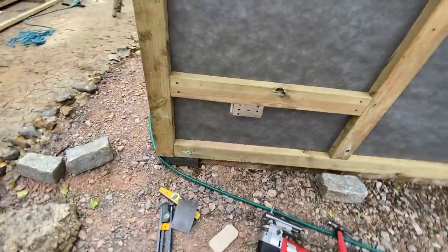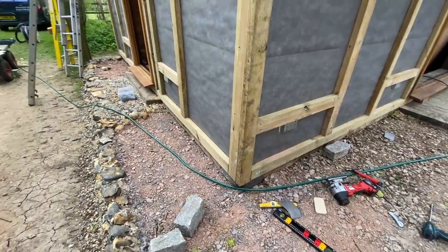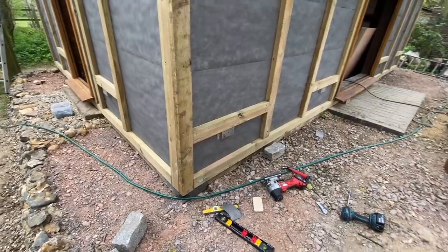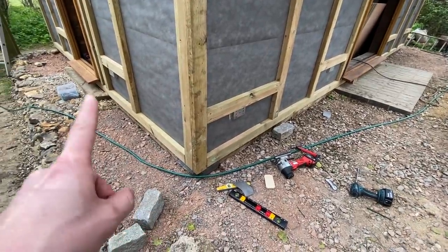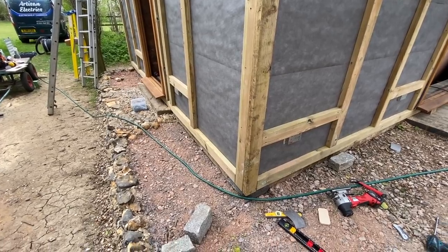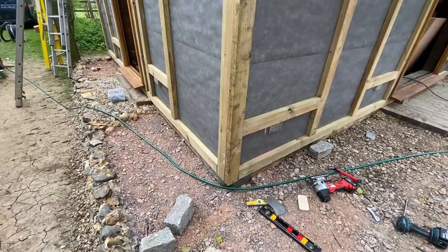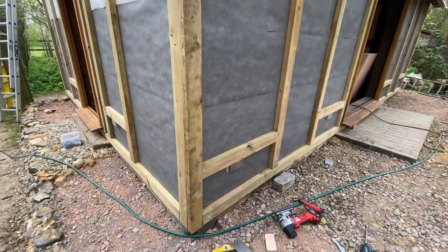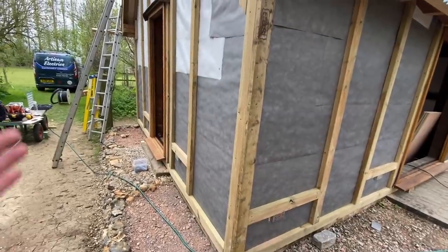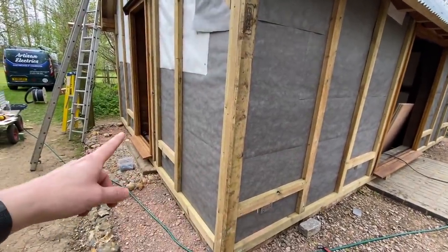And what I'm thinking, I'm doing it in 4mm SWA, but what I'm thinking is to divide the building up into two radials. So I'll do one radial for this side, 32 amp, and then the same for the other side, so that it's actually got two sets of sockets, two separate circuits. So if one trips, then there's another one that's still in place. So I'll just divide the building in half basically and run one radial on this side and another radial on that side.